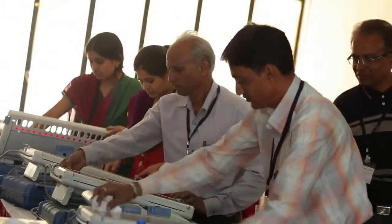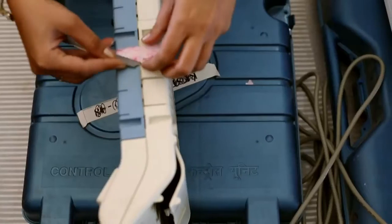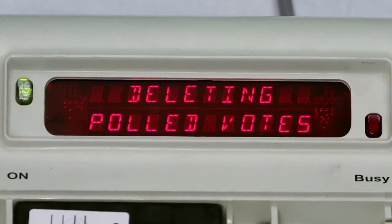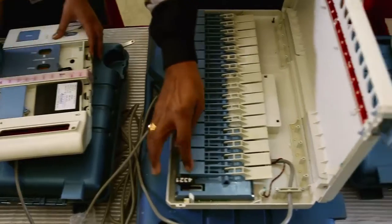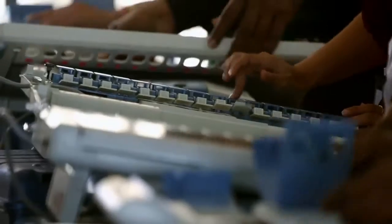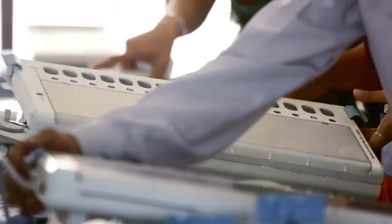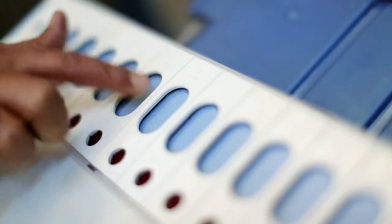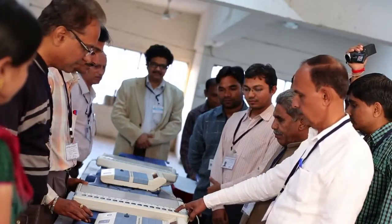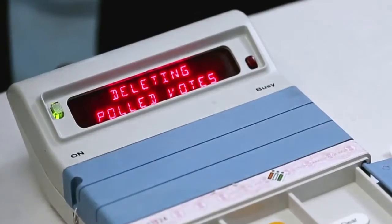An FLC involves step-by-step cleaning and dusting of the EVM, including removal of tags and deletion of past records, if any. Physical inspection of all components to ensure that all the components are original. Full functionality check of the EVM. Casting of votes against all 16 candidate switches. Observation of mock poll result and clearing of data for all machines.